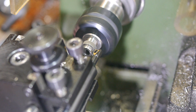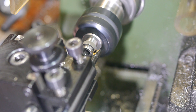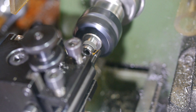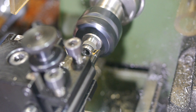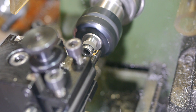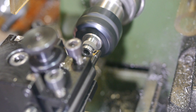I'm using a thread technique I learned from Joe Pai. The lathe is run in reverse, with the feed screw moving the carriage away from the chuck. This allows the lathe to run much faster without fear of crashing, and also allows the thread to be kept very snug against the top of the cap. I used the thread tool itself to cut the starting groove as close as possible to the shoulder. Out of shot, I set up an indicator to mark this starting position, so I could return the carriage to exactly this spot. I set the compound to match the 60 degree thread angle as usual for single pointing. I then found the outer diameter using the tool, and ran it backward and forward to clear the burr from the edge of the groove.